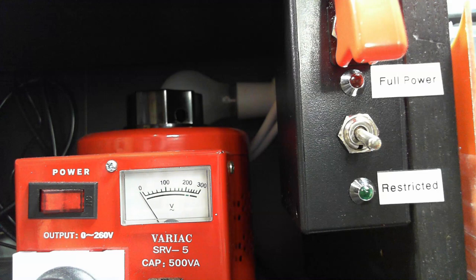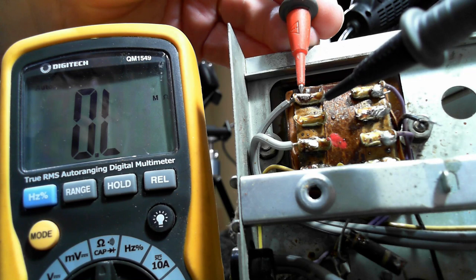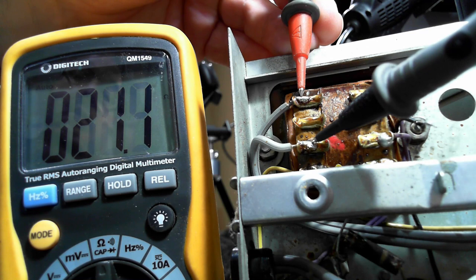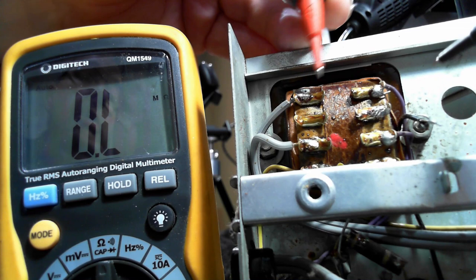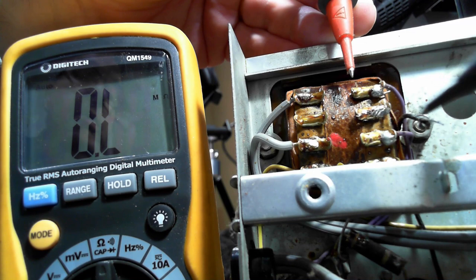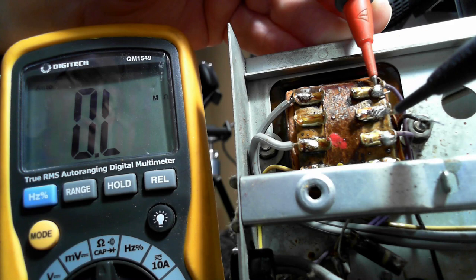Something is very wrong here. These are the primary wires coming in. I'll check that for continuity — it should be fairly low, around 20 ohms. It's not going to short to earth. These are the secondaries coming out, with the center tap. I've lifted the center tap wire off and taken the rectifier out, so all I'm measuring is these two purple wires, which are effectively disconnected.